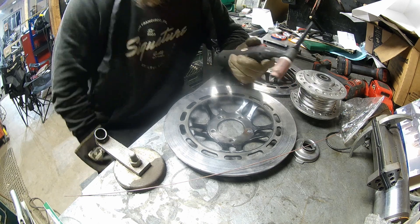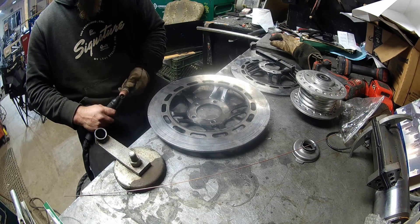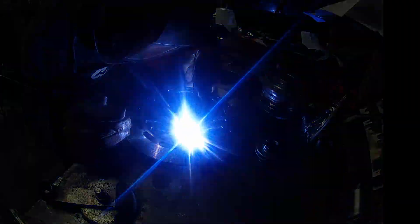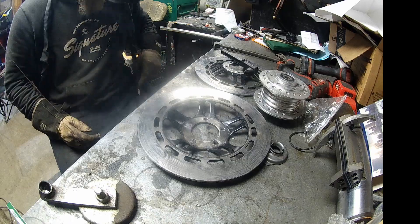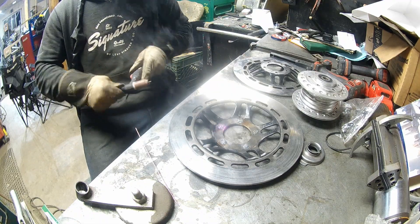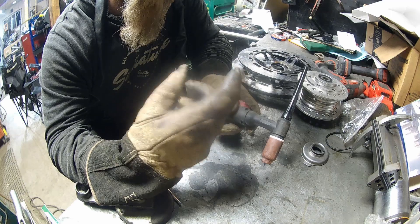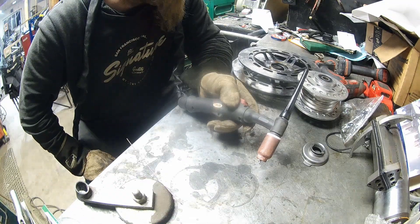I had to change up and try something else. My cup seemed to be loose. So first my cup was loose, and when I changed my bottle my regulator got knocked — I didn't notice that. I was low on actual gas, and then I bumped up my pre-flow and post-flow a little bit as well, so things seem to be working a lot better.